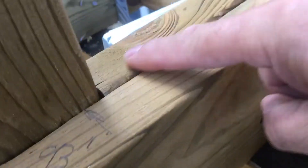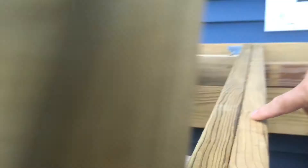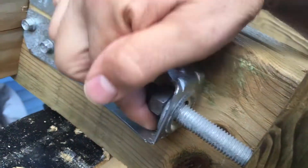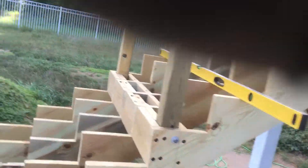Here's this middle post — the main joist is here and the middle post rests up against it. It's a four by four post, and I've got a backing joist that runs the entire length and anchors in at the back. Three-inch screws lock the two joists together. We've got a bracket locked in tightly with a half-inch threaded bolt anchored in, and a piece of locking wood between the two joists — that allows this post to not move out or sideways at all.